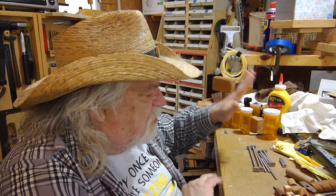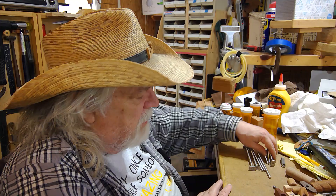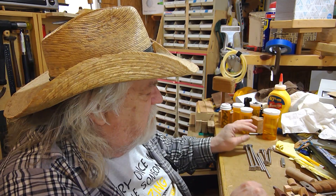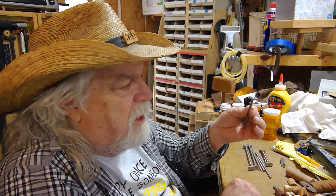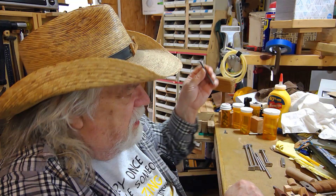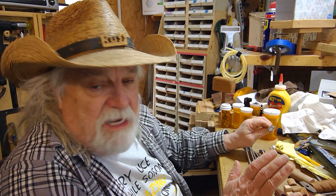What we're going to do is I'm going to give you about 15 minutes of talk here. We're going to start off talking about the T-bolts themselves, how to make them, what to watch out for, and a couple of ways to show you how easy it is — because it really is easy. Less than 25 cents is what it's costing me for a 3-inch T-bolt, and it's not difficult at all.